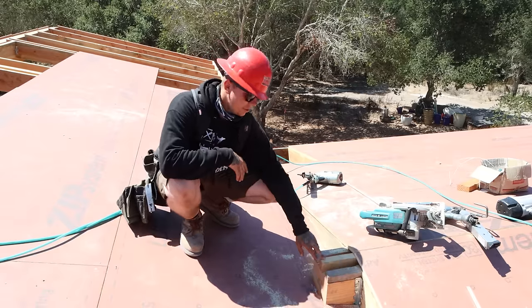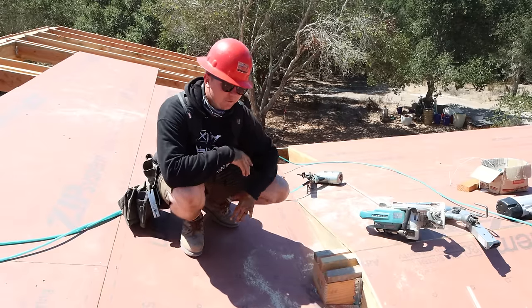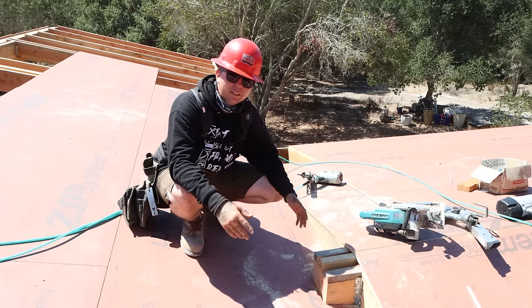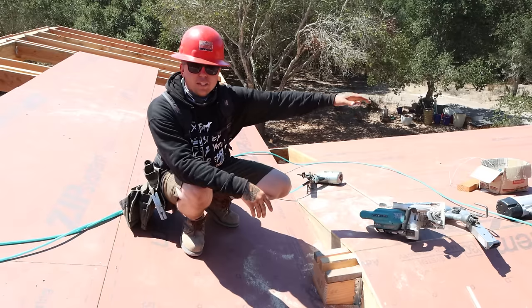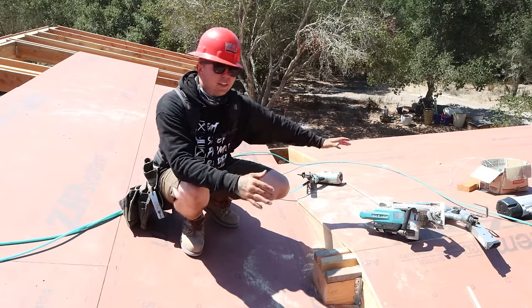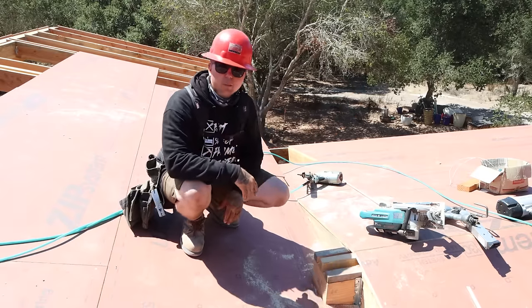But we're gonna go ahead and cut the little ridge piece coming out, get this thing framed in, get it sheeted to where it's just done. That way, as soon as we have the outside over there with the rafters done, the T&G done, we sheet it, everything from there back to here is complete.